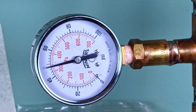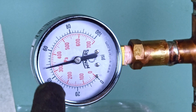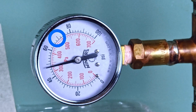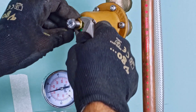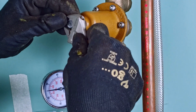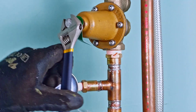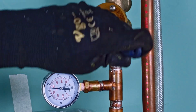At the onset, the adjusted pressure gauge shows almost 50 PSI. If you're happy with that amount, you can technically leave it set as is, but for this building we want to increase the pressure a bit higher to somewhere around 70 PSI. To do so, loosen the PRV's lower lock nut by turning it counterclockwise several times, then slowly turn the PRV's pressure adjustment bolt clockwise while monitoring the downstream adjusted pressure gauge.